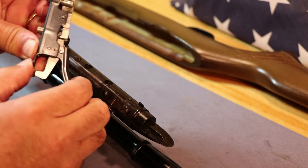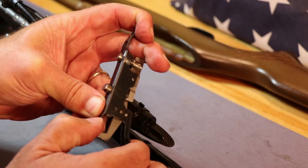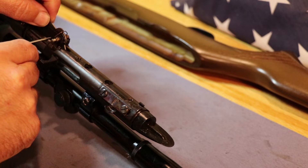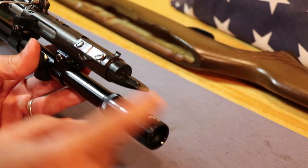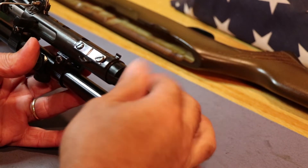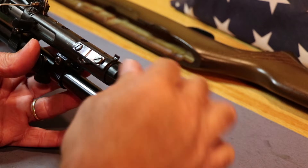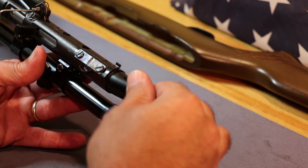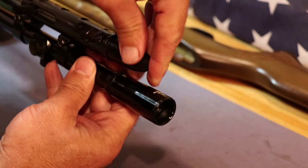It kind of works the plungers in opposite directions. Set that off to the side. Now, here's where you're going to want this Allen wrench. The back of the bolt here — this little piece on the end — I guess it's aluminum, or it almost feels like it's over-molded plastic with an aluminum insert. It unscrews from the back and should not be very tight in there, so go ahead and take that out. There's a spring in there that's going to be pushing tension up against it.